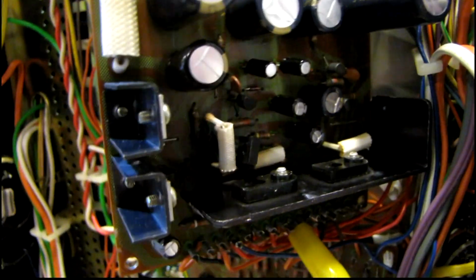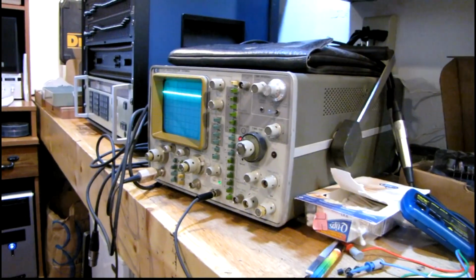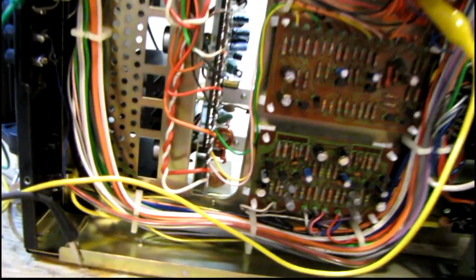I got a new transistor in there using a much heavier KSC2690AYS. Should really help the reliability. But I'm getting tired of taking this power supply in and out of here, and if it wasn't for staring at the scope at just the right time I wouldn't have caught the problem, but it was dropping out way too quick for my meter to catch, but the scope had no problem, of course. Hopefully that's the last of that. I'm just going to let this run for a while. I think it's time for a lunch break though, I'm starving.